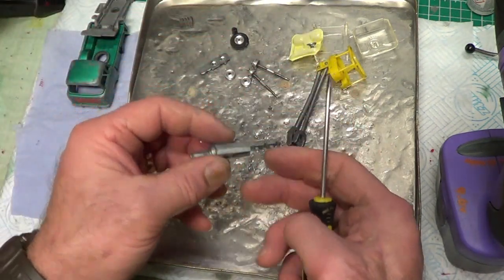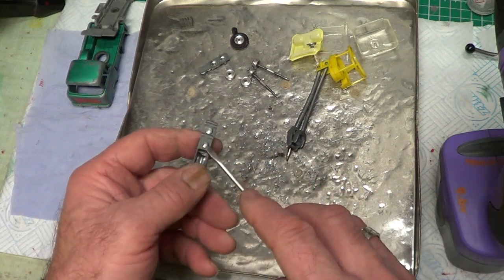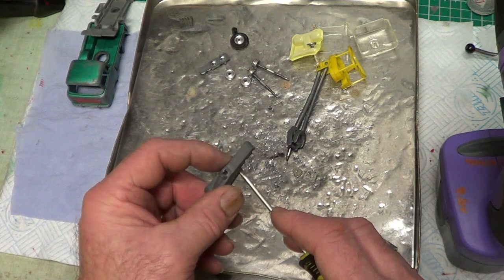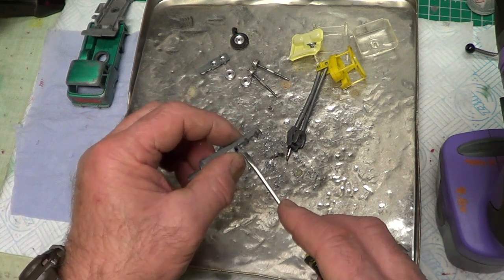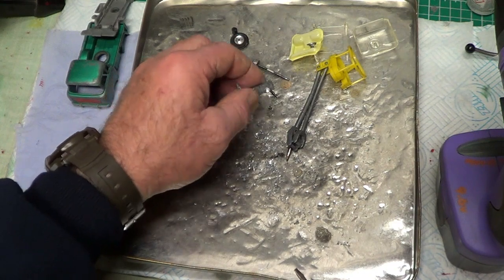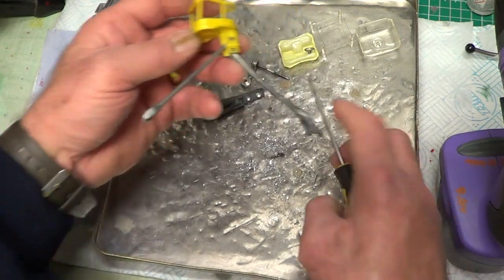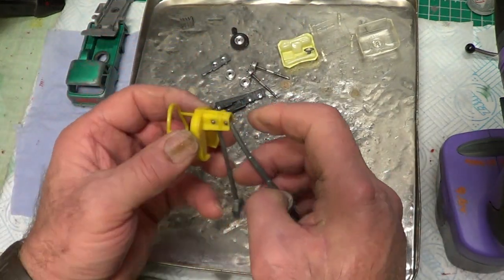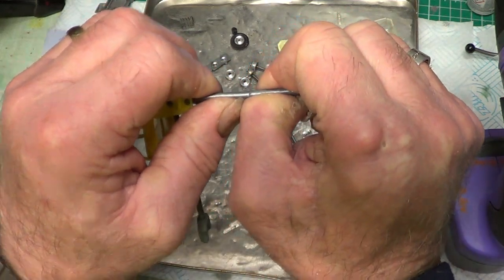Okay, well, that's that, all in pieces. So I'll have to, don't know whether I'll drill that out or not. Maybe to make it look neater, I'll just drill that out very shallow and put a very shallow rivet in there, or two very shallow rivets. Okay, so I'm not going to take the basket off because, as I say, the whole lot can go in the ultrasonic cleaner. This is slightly bent, but we'll just straighten it like that.